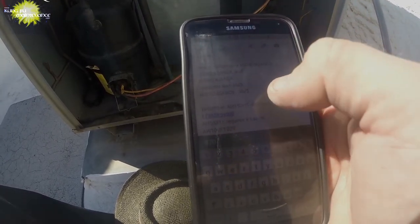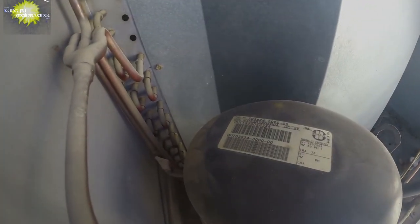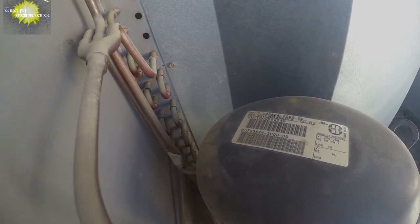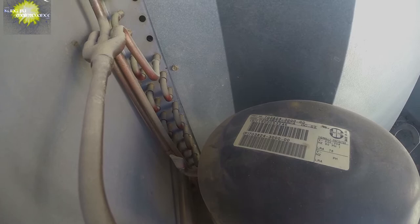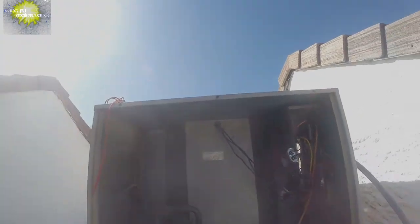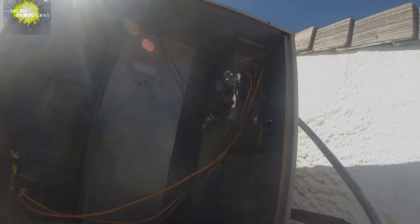Looking up the Bristol H23B28QABCA — it's a 35. So we'll write that inside. This way we don't have to look this up again next time — we'll have it mapped out for the next guy, which very well may be me. And I do believe this one has the wrong capacitor on it, so we're going to test that.